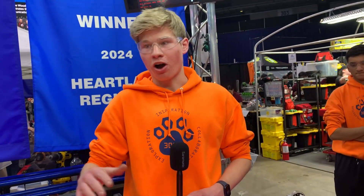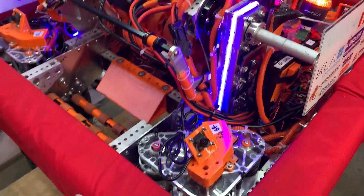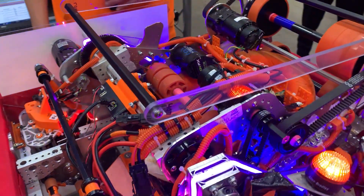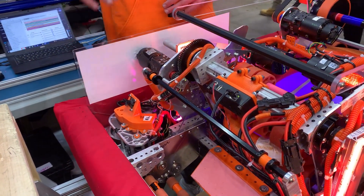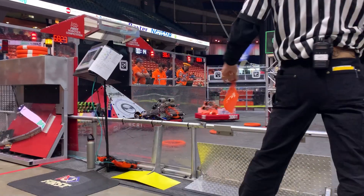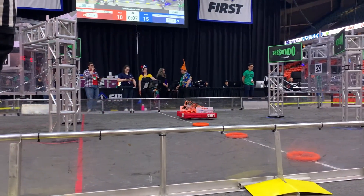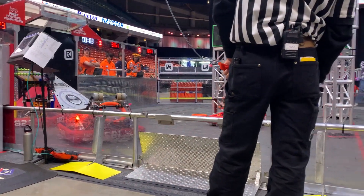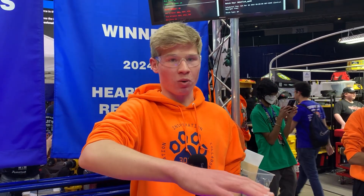Building on the whole idea of automation, we have four cameras on our robot — one in each swerve module on each corner. These are all controlled by the Raspberry Pis Jay was talking about. We run a software called PhotonVision on each Pi. That software allows us to use data drawn from the cameras as they see AprilTags on the field to know exactly where on the field we are at any time, whether doing autonomous or teleop. We use that information consistently to do automated tasks such as autonomous — we can have very advanced paths using Path Planner to have five or six note autos. We also use them during matches so when Ian, our driver, wants to aim at the speaker, the robot can know where it is on the field and do simple trigonometry to figure out what angle it actually needs to face to always be pointing at the speaker so the robot can score.